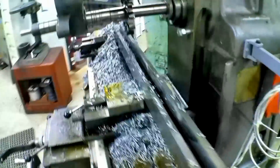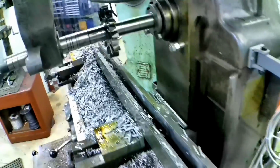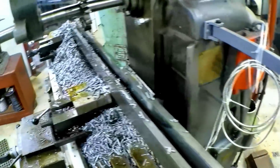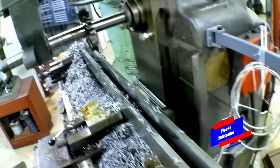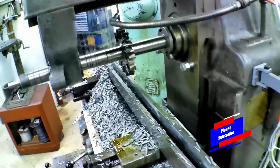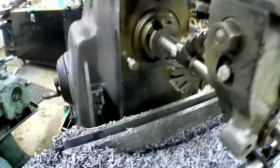So there you have it. 4 foot of bar, 1 3/4 deep, 1 inch wide, all milled with that cutter. The first section, we did 3 passes, 5/8, 5/8, and then 1/2 inch. And the second one, we did 2 passes of full 7/8 depth of cut, feeding 1 1/4 inch a minute at 33 RPM. And it handled it just beautifully.